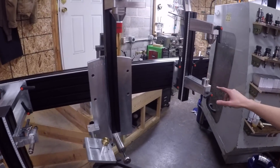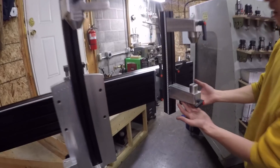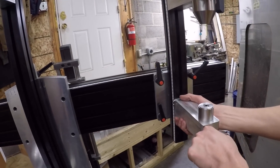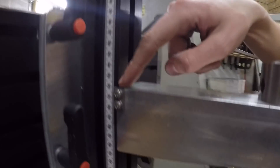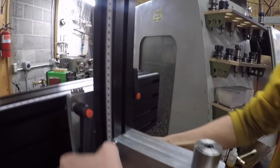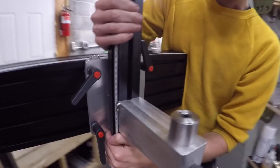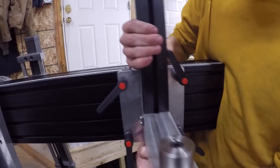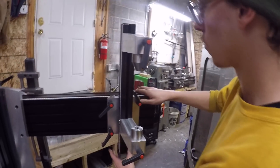BikeCAD gives you the XY coordinate points. For instance, if I want to change the y adjustment for the bottom of my head tube, I loosen this and slide it according to that rule with this calibratable reference. If I want to change the x for my head tube, I have to loosen all four of these goddamn levers — that was a mistake designing it that way. It's also kind of tight; I didn't want it to be sloppy, but it ended up being quite tight and hard to slide and hard to adjust.